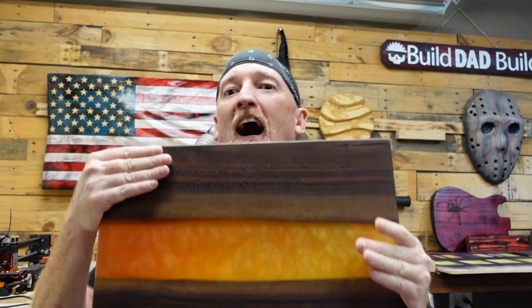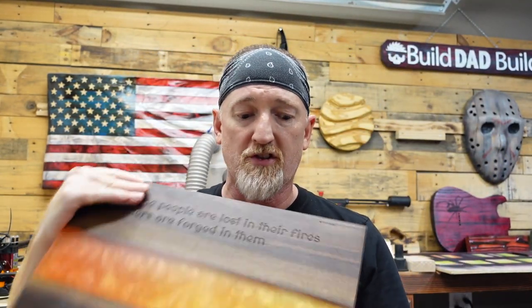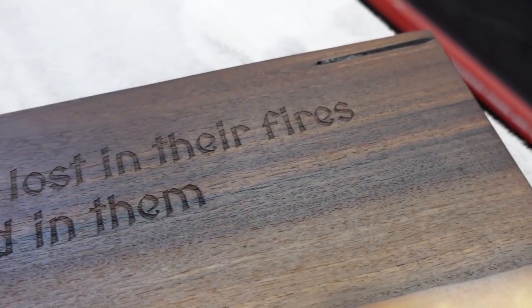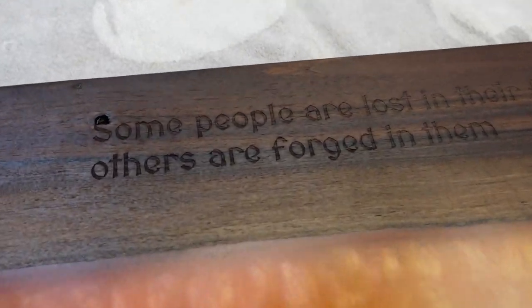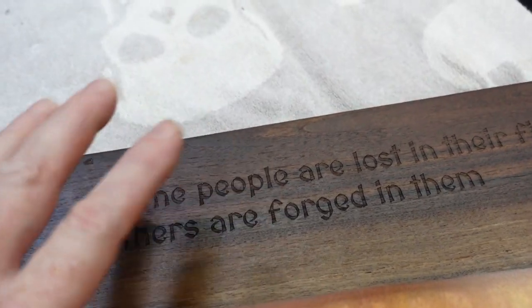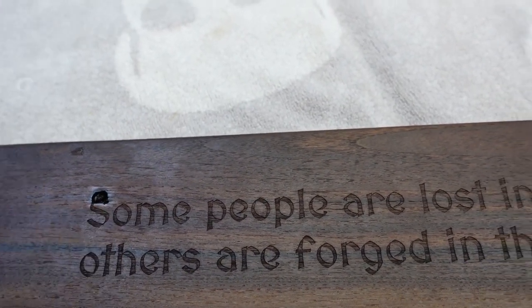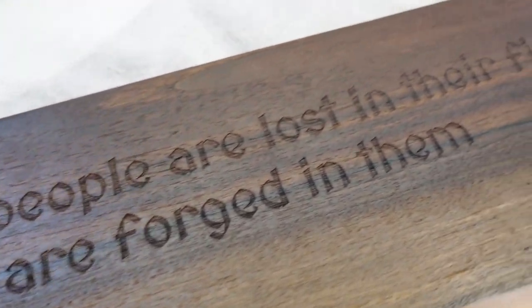Let's talk about this board. The board itself I think looks really good. This is not the effect I was going for with the epoxy, but I really like the way it looks — I like the transition from orange to yellow. I kind of wish I'd used more red for a better transition. It looks amazing, and 95 to 98% of this carve looks great. And then — bam — I legitimately didn't check my settings. In LightBurn, text is normally treated as an engrave anyway, but in Retina Engrave 3 you actually have to rasterize the text to make it engrave. So that was 100% user error. Luckily I noticed when the software said it was going to be seven hours to engrave, and I looked over and it was just powering a hole right through. So aside from that, I think it looks awesome. It is a good second draft.